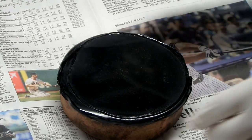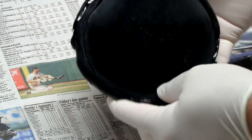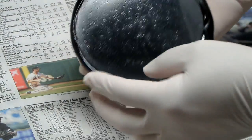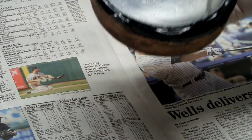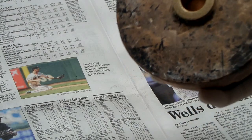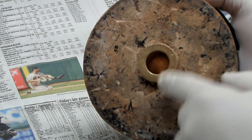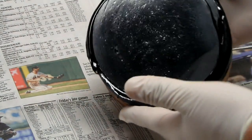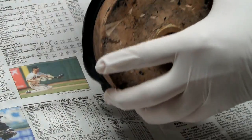I'm Gordon Waite. I'm getting ready to do polishing on the 22-inch mirrors for the Binoscope project and I made up a bunch of pitch polishers. I poured them last night and it's time to facet them and get them ready for operation. This is the first one I'm going to cut, done on a 5-inch substrate. The substrate is dental plaster and has a bronze bushing in the center to adapt it to my machine. The first thing you have to do is get rid of the overhang.